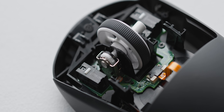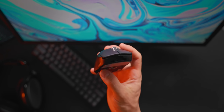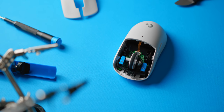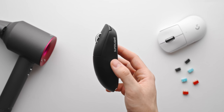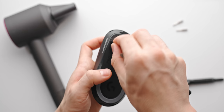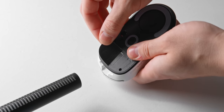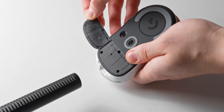In the case of the G Pro Wireless and other Logitech mice with Omron switches, you'll also be avoiding the dreaded double-clicking fault that these switches are very prone to, so a nice upgrade here means you'll never have to encounter that. To access the switches on pretty much any gaming mouse you will need to open up the mouse, which involves removing the stock pads and potentially making them impossible to reuse. So it's essential to get your hands on some aftermarket pads like CorePads if you haven't already — that way you get a nice upgrade to your glides as well.